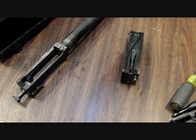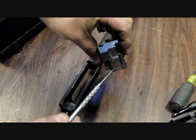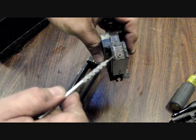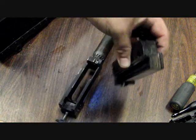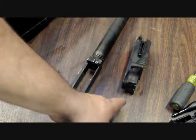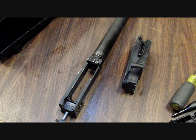If you really study how headspace works in the 1919, you have a T-slot right here and the barrel will come to rest against that face of that T-slot. That's what sets headspace on the Browning — this notch right in here. It's already built into the bolt. You just want to make sure that you have the barrel tightened in tight to the tracks on the face of the bolt and then backed out one or two clicks for heat expansion.